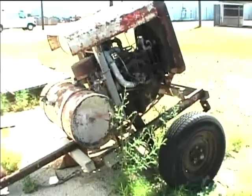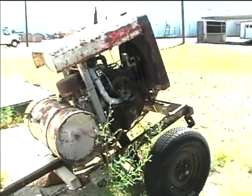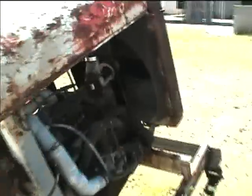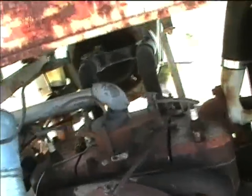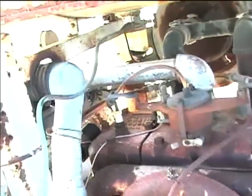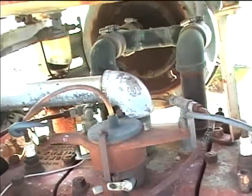This is an air compressor. Pretty soon I'm going to get a new tire on the trailer and haul it home to continue working on it. It's got a special head on a Ford Model A engine where the center two cylinders are for compressing air. The engine runs on the outer two cylinders — you can see the spark plugs on just the outer two — and the middle part connects to the air manifold, which goes out to the air tank. Here's the distributor; only the outside two cylinders are hooked up.